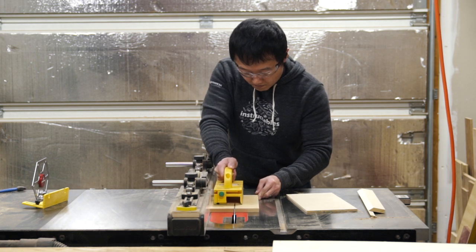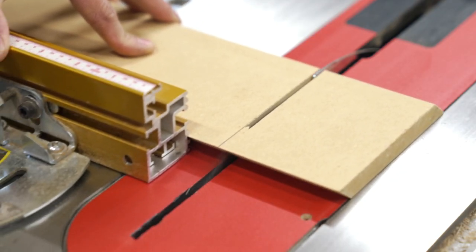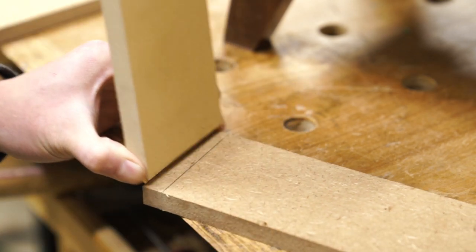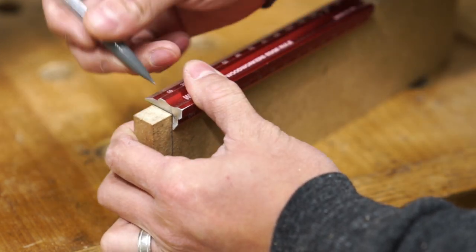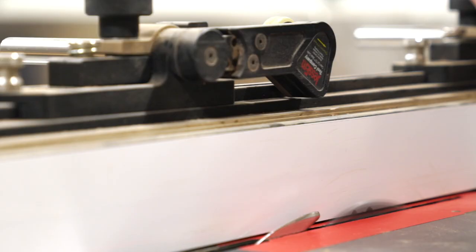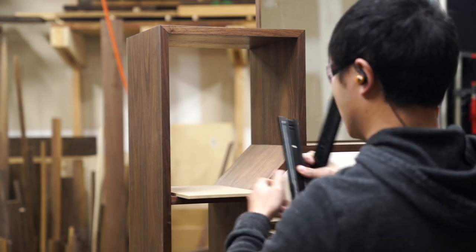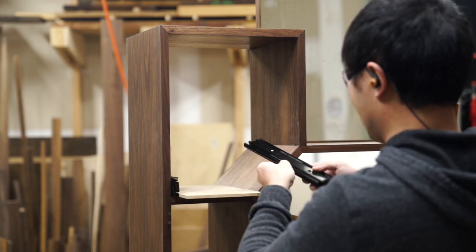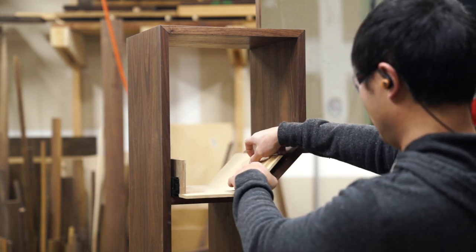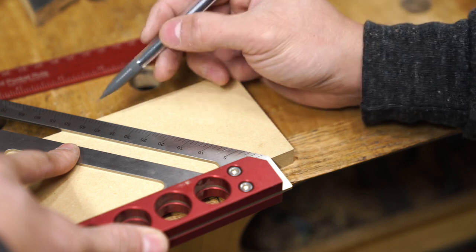The other three panels of the box were all cut with the blade set back to vertical, but I had to adjust the fence slightly to make sure that these vertical panels will end up being flushed to the angled panel once they're sitting properly in the opening. I only cut the side pieces to their final lengths because they'll both receive rabbets for the front and back panels to sit in. So the length of the front and back panels will be determined after a dry fit. With the drawer slides and the side panels placed in the opening, I marked where to cut the front and back panels, and since they'll both get a 45-degree cross cut on one end, I marked the line so that I don't end up cutting the piece too short — which I've done before.